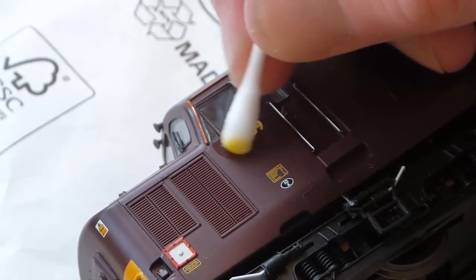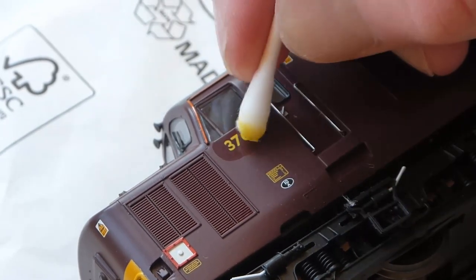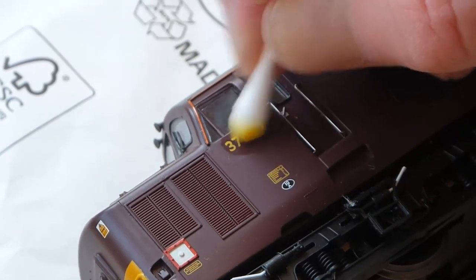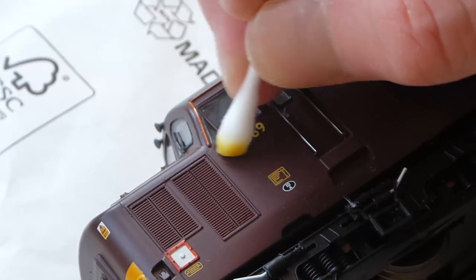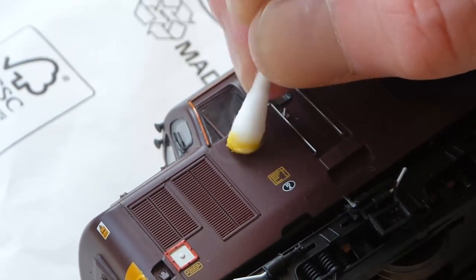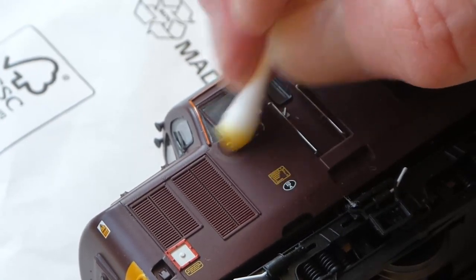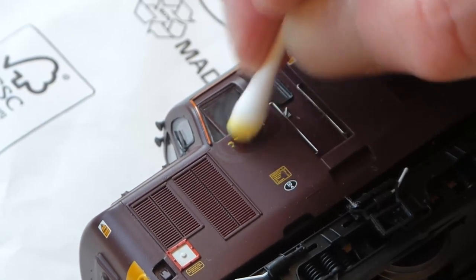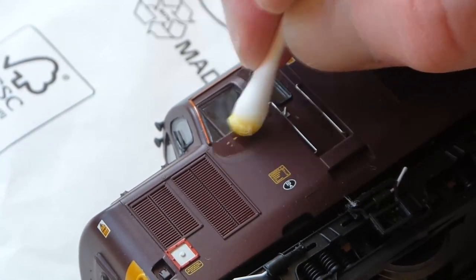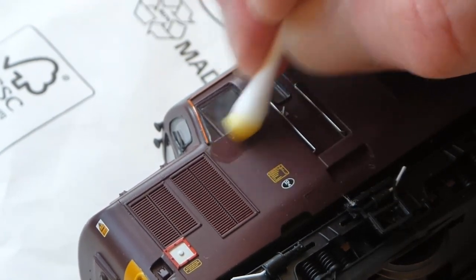The technique I'm using is a cotton bud soaked in isopropanol, then just gently rubbing away. You can see in the bud that we've got the yellow paint from the number, but we're not lifting any of the maroon — and that's what we want. We take our time and gently rub away, concentrating just in the area with the numbers, using very light pressure. Isopropanol is a really good solvent because it's not too strong — it just works in the area we're applying pressure to. You can see now that we've pretty well got the number off without lifting any of the maroon.